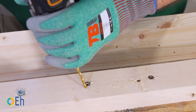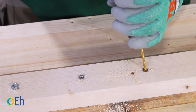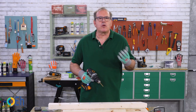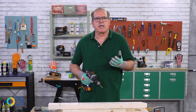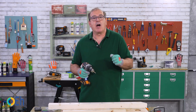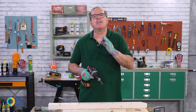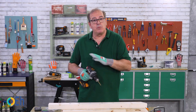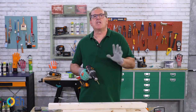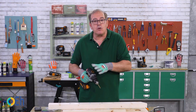And since we can't do it well like that, we turn to a drill bit. Notice we always tell you that when you buy things that come with screws, check if the screws are of good quality, which is not usually the case. If you use quality screws like these, there's no problem because in general, even if you use the tip badly or even if you over-tighten them, they usually endure and survive. But with screws that are not of good quality, it's a disaster — you automatically destroy their head. So if the screws are not of quality when you buy them, the best thing you can do is throw them out and put good screws.